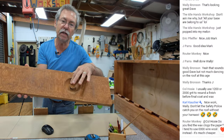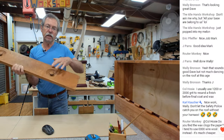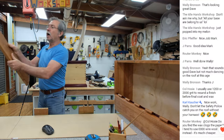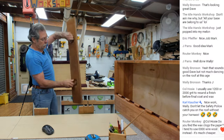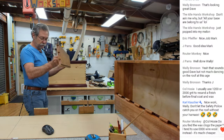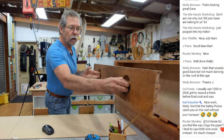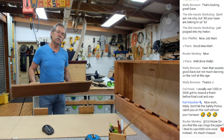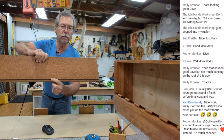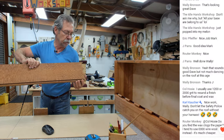Now it has these handles in there already, but the problem is the handles go down very deep into the board. Like they're just milled into it. I don't know how I got that done. So I'm wondering whether I should incorporate this and have those as the two handles to pull the till out, make this the front to go in there. And then this would pull out. What are your thoughts? It already has a 4 millimeter rebate, or dado, I should say, through there to support the plywood floor that was in it.